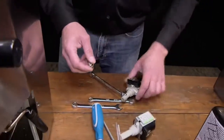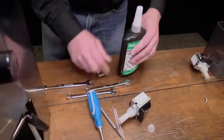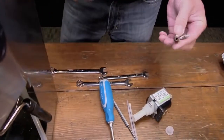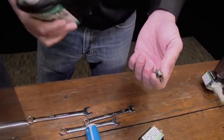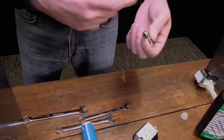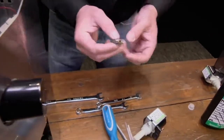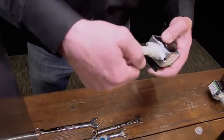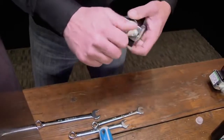Now we've got the new pump. We've got the sealant we use — again, you can use white Teflon tape. I'm going to put a few drops right on the threads, and that's it. If you're using Teflon tape, just wrap it around about twice — two layers. You don't want to put a whole lot on it because there's not a lot of space, but a couple of layers creates a better seal. I always like to put a little sealant on it anyway for extra benefit.